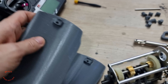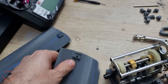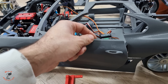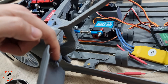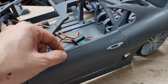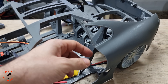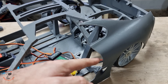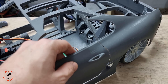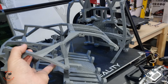We have another adjustment on the door — it was like this before and now it's like this. The door hinge is going to hold that lip and not turn. I already put the driver's side door on and now it's not twisting up or down, the hinge is perfectly aligned. There was another problem: the door was going inward because there was nothing to hold it. With the new chassis it has a magnet mounting point on both the door and the chassis.